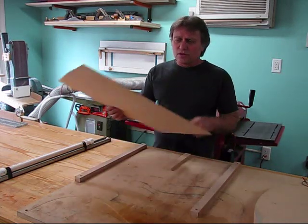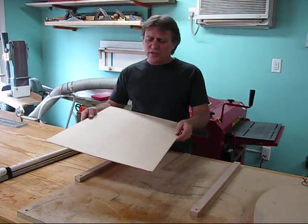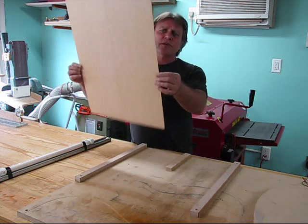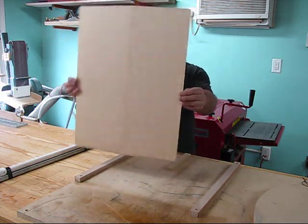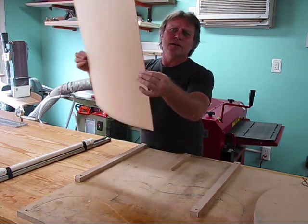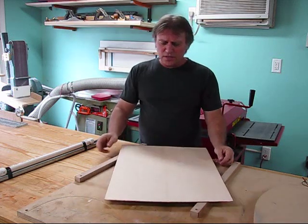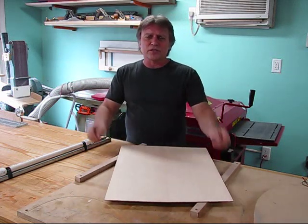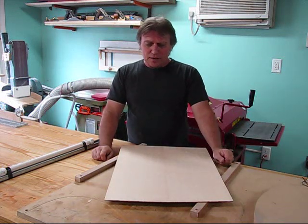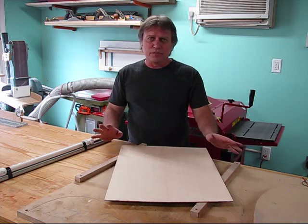I also found the Kent Everett system — what he does is go by the sound. You'll take the top and it'll kind of destroy the integrity to it, the structural integrity, to a point where you wobble it. I don't know if you can even hear that — this is at an eighth inch right now. There's a little bit of a wobble, but when you wobble it and it's right, it's like sheet metal — they call it — it just goes wobble wobble. You'll see how that works out.